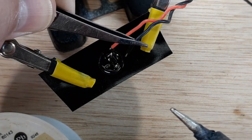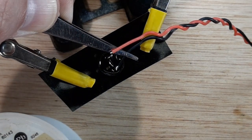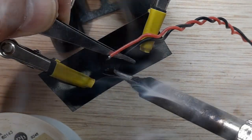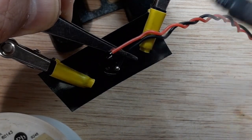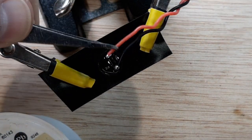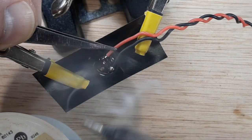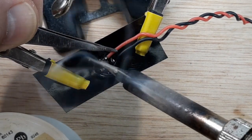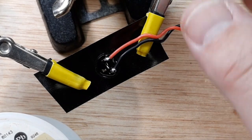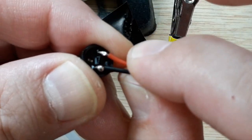We'll start off with our negative wire, put a little bit more solder on there. Then our hot five volt line - we'll go ahead and put it on with a little more solder, just barely touching it, then setting it up. Now we're done soldering. I'm going to pull on it - not too hard - just make sure it doesn't come off. Good, the soldering is done.